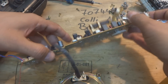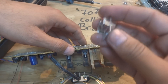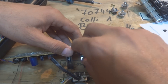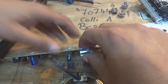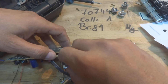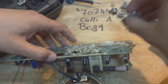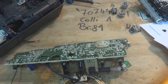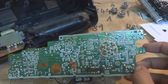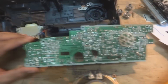So now it is back-probed. The machine and power is there. And of course we have to set it to radio. So now this is set to radio. If we see this pin number 12, where it is leading — that will be our point to trace down the circuit.